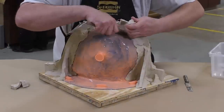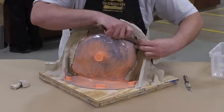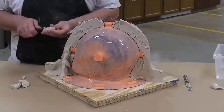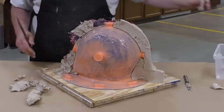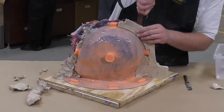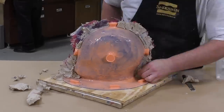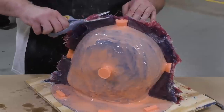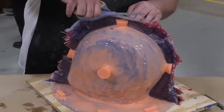After a full cure, start by removing the clay wall we built up earlier. I'm using a wooden sculpting tool so we don't accidentally cut or puncture the mold. Once all the clay is cleaned up, go around with a pair of scissors and remove any high points of glass that are sticking out — these are quite sharp, so always be careful to avoid cutting your hands.